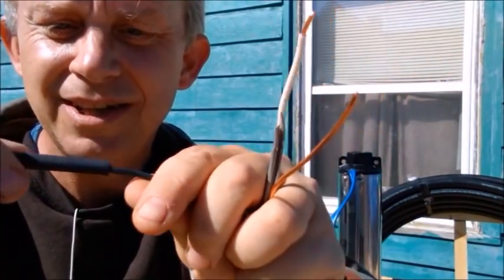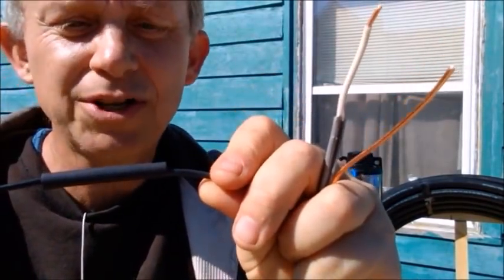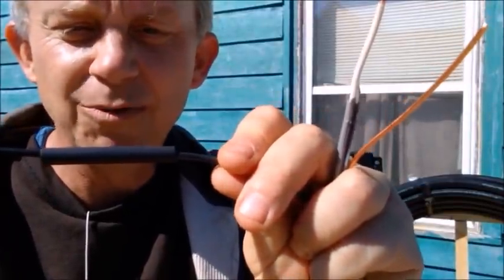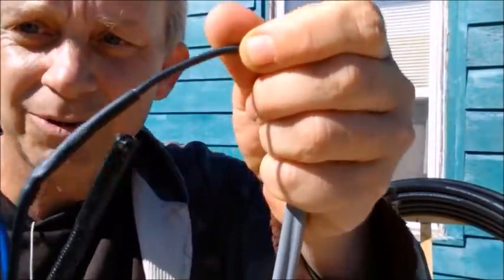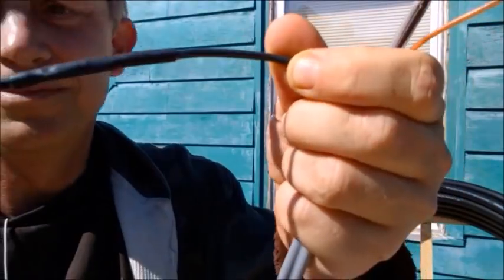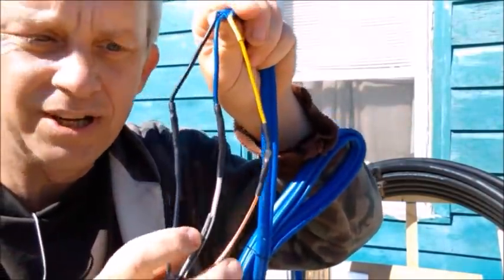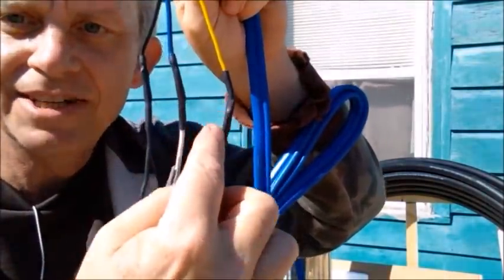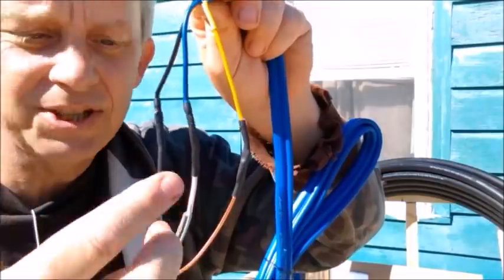The wire's connected — slide the sheath on. The video I watched by an actual plumber, that's all he used. But I'm not a professional, and once I get the pump down in there I don't want to have to pull it back out. I've got all three wires done: the hot, the negative, and the ground — they're all sealed up. I didn't have to seal the ground the same way, but I did anyway since I had an extra one. Water's going to get down in the ground wire no matter what, because the water itself will create a ground.